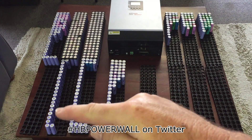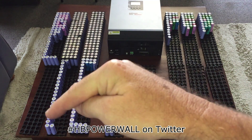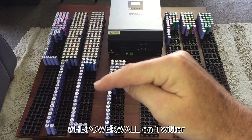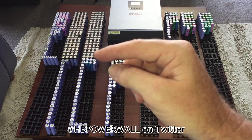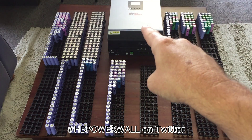The reason these are all set up like this is because they're all blue batteries and I'm going to turn them over on their side so they'll be blue all the way around the outside - just for aesthetics. I'm going to do them in 80-packs, so 80-pack there and 80-pack there, so I can turn them on the side, put a strap over the top, and there's less stress on the batteries on the corners. It'll only be about three and a half kilos each battery pack.